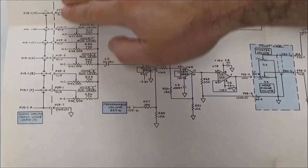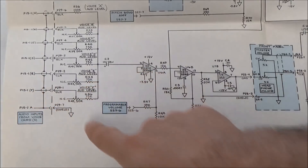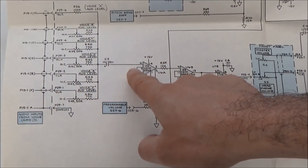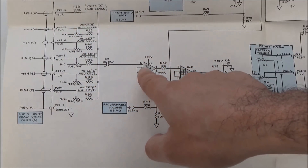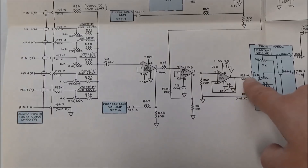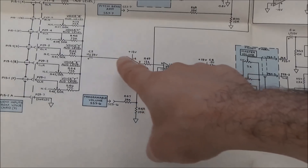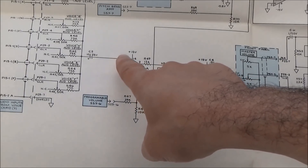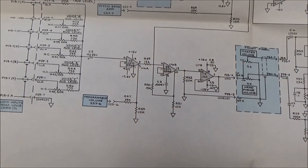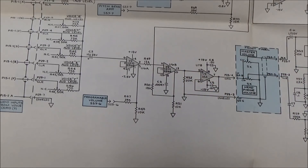I'm going to probe on this connector and hit some keys. And actually I do see some output there on the oscilloscope — that does look like an audio waveform. So it looks like we're getting output from the voice card, but for whatever reason we're not hearing it. The problem could be with the final VCA or it could be with some op amp buffers that drive the headphones or the output jack. So let's get the schematic and have a look. We were looking at pin one, which is voice F, and we were seeing an audio signal. This comes across a capacitor and goes into the CEM3360, two stages of that, and then into an op amp, and then out to the next connector which takes it to the volume controls.